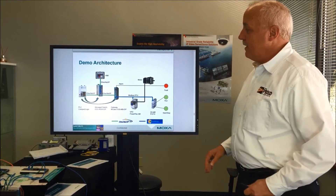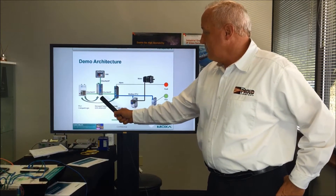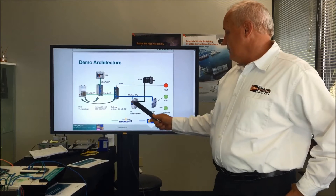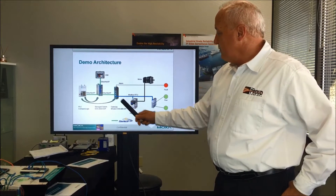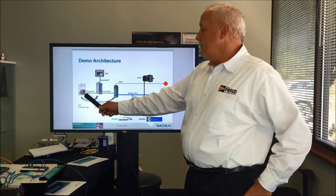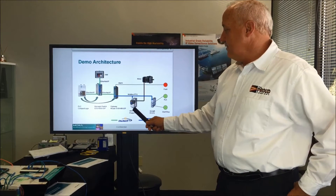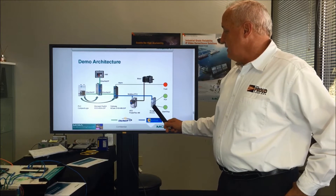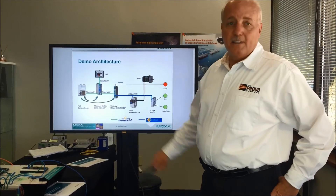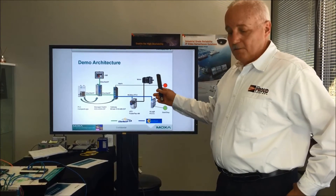Up on the screen we have the demo architecture, where we have a CompactLogix PLC that connects through the Ethernet switch, an M-Gate — which is a device that converts EtherNet/IP to Modbus RTU or TCP — and we're going to control an Allen-Bradley drive with the CompactLogix PLC sending EtherNet/IP commands over the network to the M-Gate. The M-Gate will then speak Modbus RTU to the drive serial port. We're also going to show how we integrate with Moxa's IO logic on the RTU bus to actually get alarms and send them back to the ProFace HMI. So we have all Allen-Bradley over here, and all Modbus on this side, and of course the motor over here.